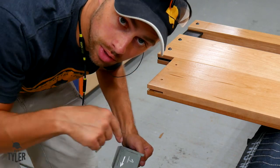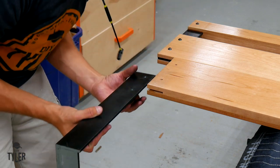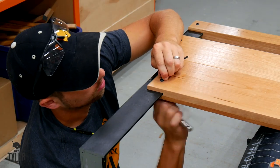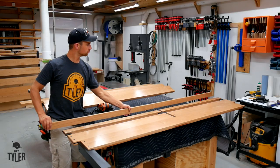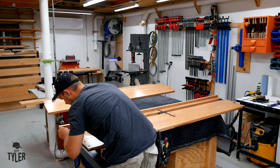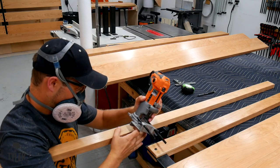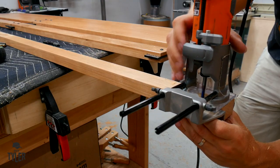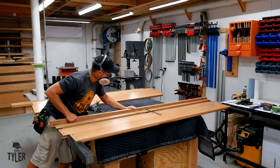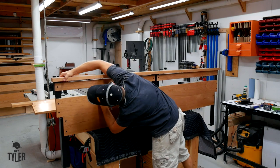Remember that we marked the legs going clockwise from the front left corner with an arrow pointing toward the back wall, so this is the appropriate leg for the footboard. Now that we're mostly done with the assembly of the footboard, it is time to add the last piece which is the top rail. I made sure it was aligned, then used the footboard itself to mark out for perfect alignment. Using a quarter-inch bit in the router I cut three mortises — one for each side and one for that four-inch middle flat stock.